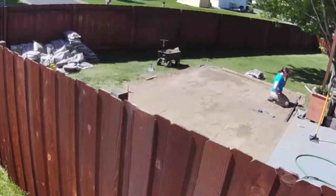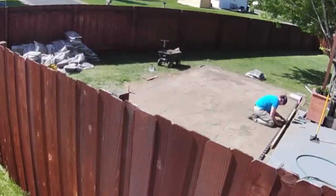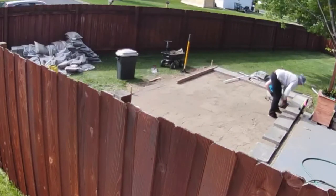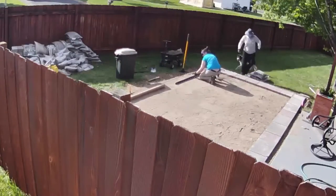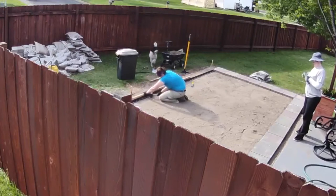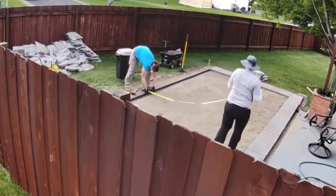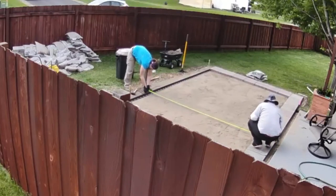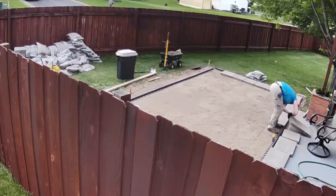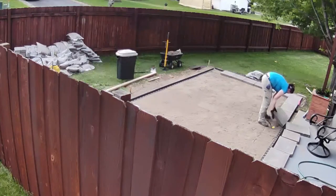We purchased paver edging — little plastic pieces, similar to garden edging, just branded differently. I wanted to get an idea of where the outside should be, so we laid the edging around and actually picked up all of our pavers and laid them out to put the edging in place, check that everything was square, then picked all the pavers back up so we could lay the next level of sand. It was the only way to ensure everything would fit by doing a sample run first. Now that I have the edging guide down, I don't have to worry when doing the leveling sand.